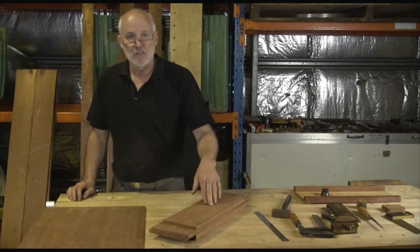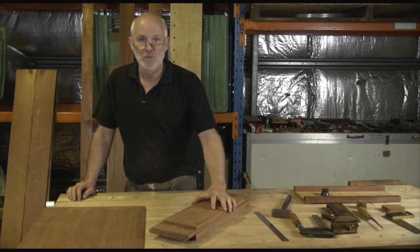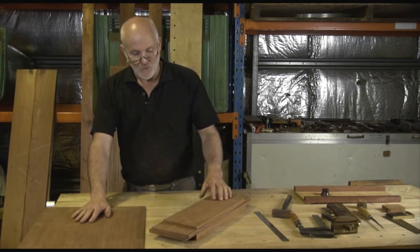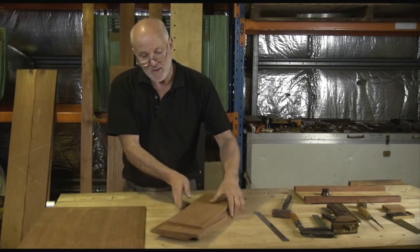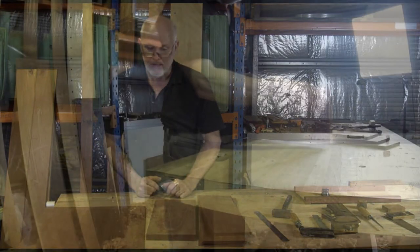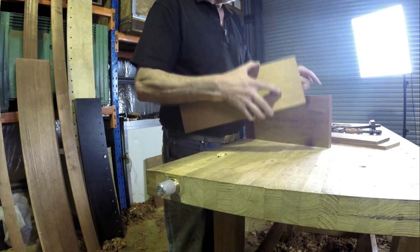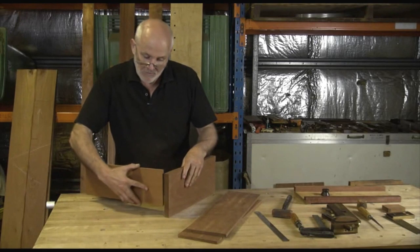What I want to show here is how I can make the drawers for these bedside tables using simply a quarter inch dado plane. That's the bottom of the drawer, quarter inch thick. My two sides, the back and my drawer front. They've all been dressed and hand planed to finish. We'll be cutting a rebate here using the dado plane, then we'll be cutting a small dado here, fitting those two together.